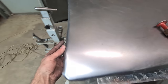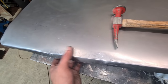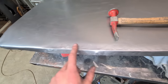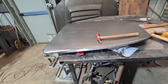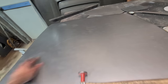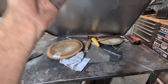Gave it a little bit of a shrink and now I'm sharpening the edge up because it's really rounded off from tipping it over. Dolly underneath, tapping the top surface to sharpen this top area up, then I'll tap the side round and shrink it some more to give it whatever arc it needs. I might need to wheel the center depending on where it pulls.